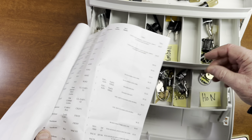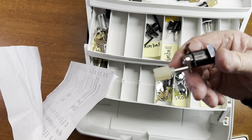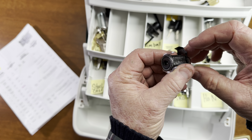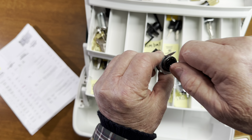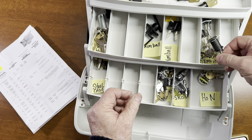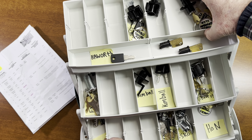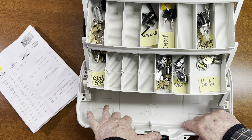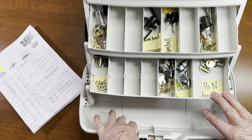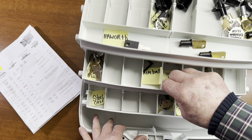Some are for the lockers I want and some aren't — this one's for a file cabinet. I don't have any pinning kits for these wafer locks because honestly there's no money in it. We've already went through that on last videos. If you try to repin these in the field, you're just wasting your time, energy, and effort, and you'll charge the folks way too much. Just order the cylinder — you order these already keyed up.